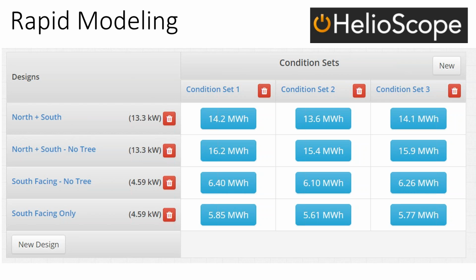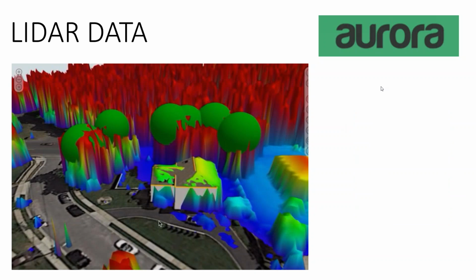And so in our Design Your Solar Roof class, we go through some of the process of clicking on your roof surfaces, sketching it out, assigning it height, and doing a shade model. But the real advantage of Helioscope is that it's more simple than Aurora. With Aurora, for example, it is programmable. So you can tell Aurora what module you like to use, what inverter you like to use, what array configurations you like to use in terms of rows of modules, not doing little small sections but nice uniform selections. And they actually have an optimizer that will design the whole array for you with a click of the button once you get it all programmed correctly.